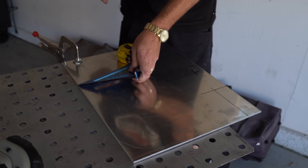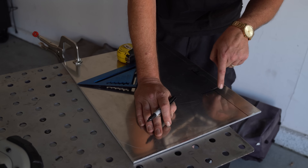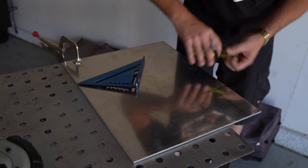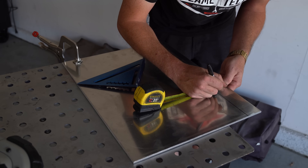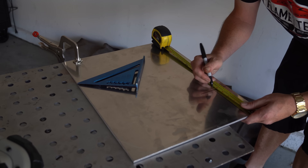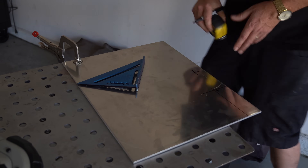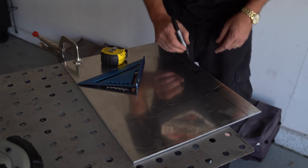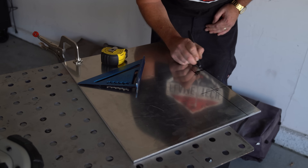Just to make it look nice, I don't want a perfectly square cut. What I'll do is drill it with a half-inch drill and that'll give us a nice radius corner. Mark a quarter-inch in — if I put a half-inch hole right there, that'll give us a nice radius around that corner. We'll obviously be slicing this whole section out here just for the blade to clear.